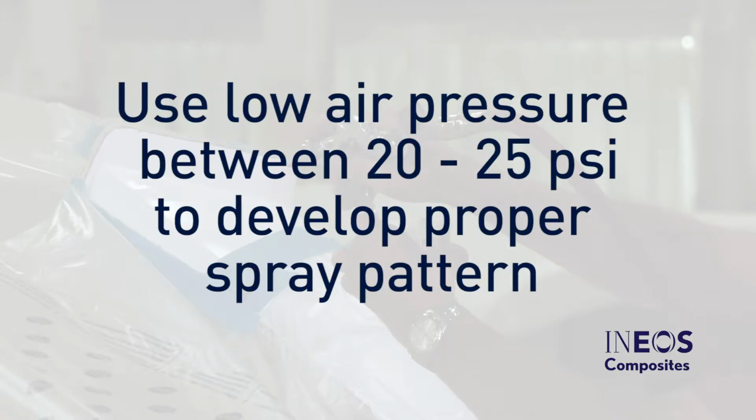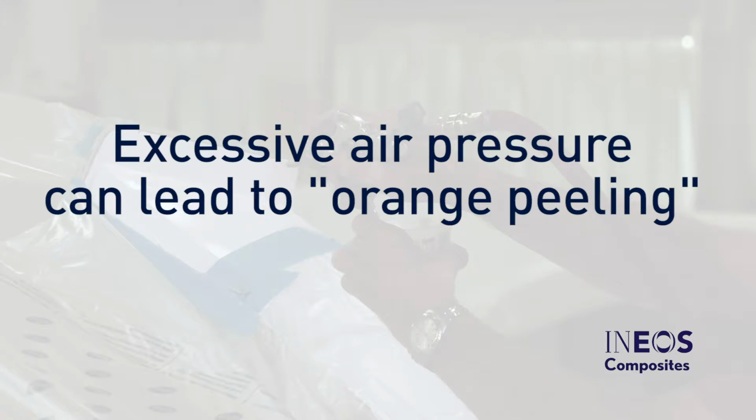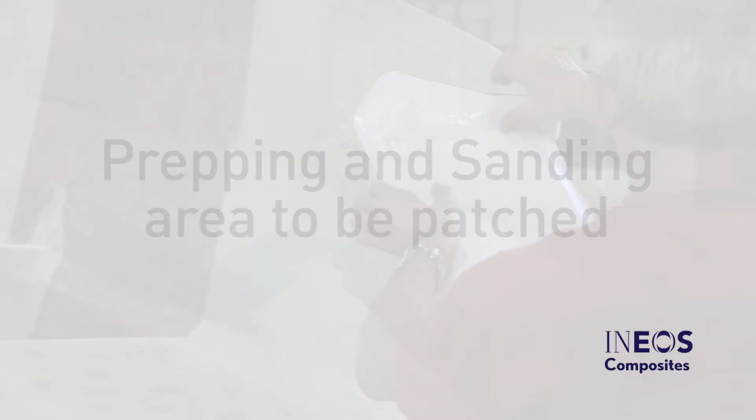Low air pressure between 20 and 25 psi is sufficient to develop the spray pattern. Excessive air pressure will result in a rough surface on the patch, also known as orange peeling. Orange peeling is often difficult to sand out and may require the patch to be completely redone.